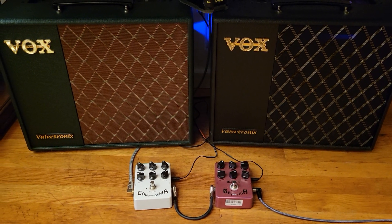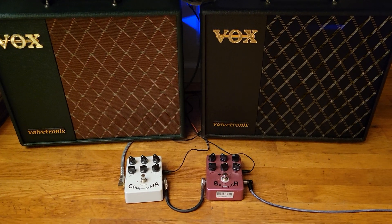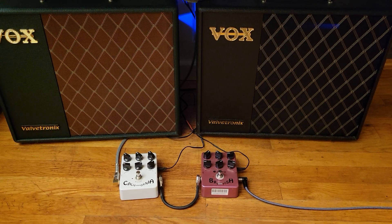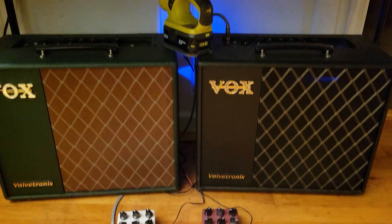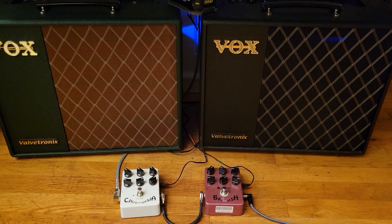A quick video to show you one of the ways you can power your Vox VT40x. These amplifiers take DC input — they come with an AC to DC adapter, 120 volt AC to 19 volt DC. I've tested it down to 12 volts and anywhere in between it works fine. In this case I actually have it powered by a Ryobi battery, which is somewhere between 17 to 20 volts roughly.